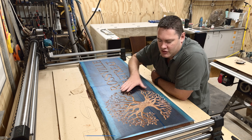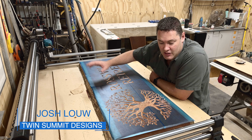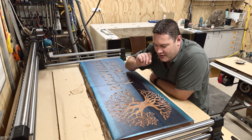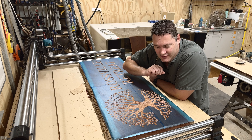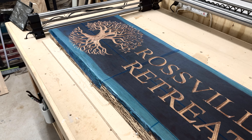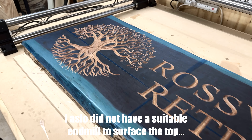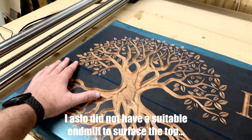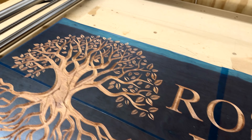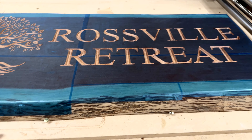When you've got an image to engrave on a big surface like this, but you know there are high spots and low spots everywhere, it can be a little tricky. With this particular slab I couldn't get it milled down perfectly flat, and I don't have a machine to do that myself, so I had to use an orbital sander. Basically, that means you're naturally going to get some high spots and low spots. This is also a very dense, hard wood and really hard to work with.